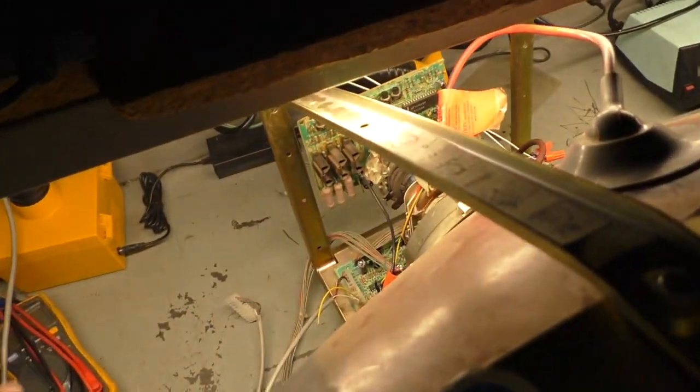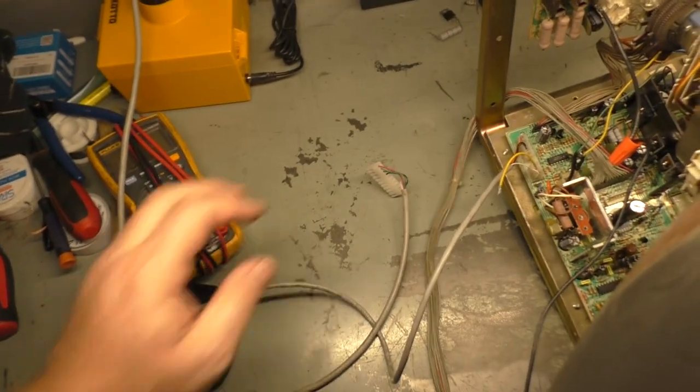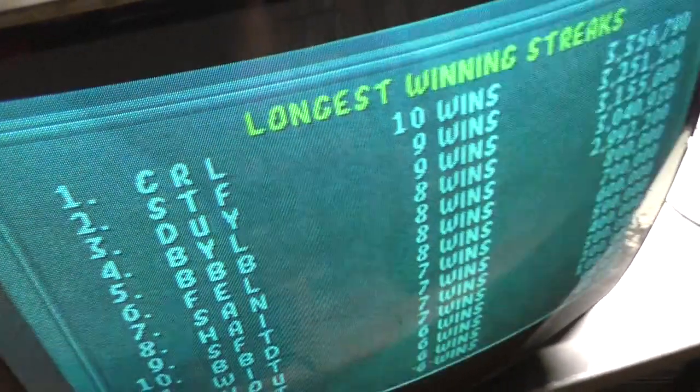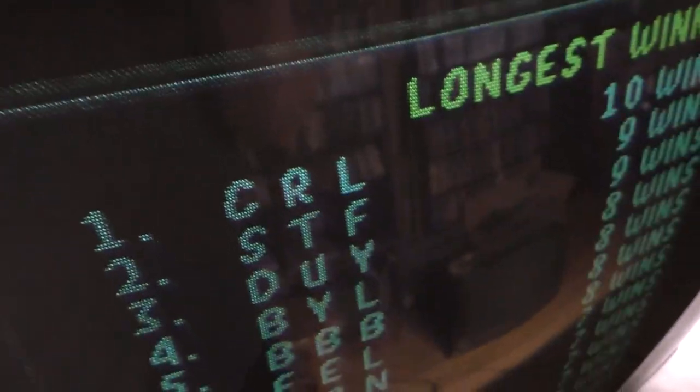There we go, RGB. Okay, now let's go ahead and give us an actual video signal from a PCB. So we will turn off the test pattern generator, disconnect it, set it aside, and give an actual video signal from a PCB. The TPG is a lot more energetic when it comes to the video signal, so we need to turn up brightness. It's too high. Right about there's our brightness, contrast. What the heck? Is that an H-hold issue?